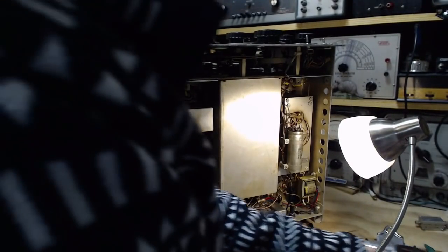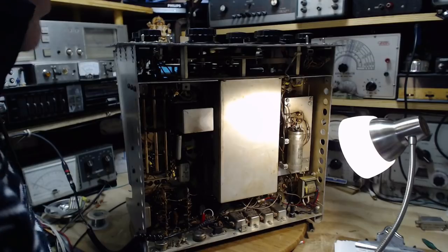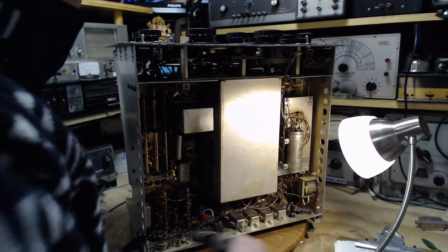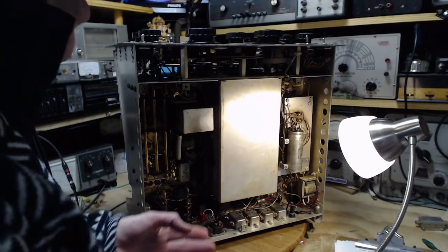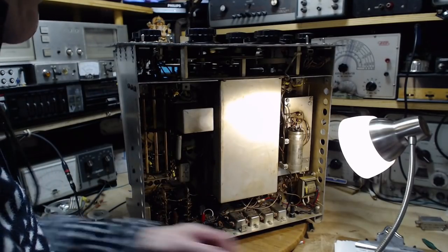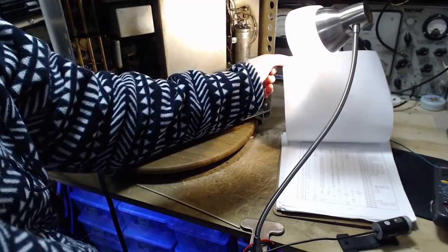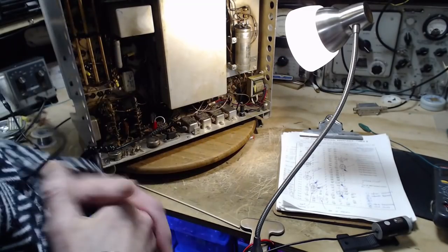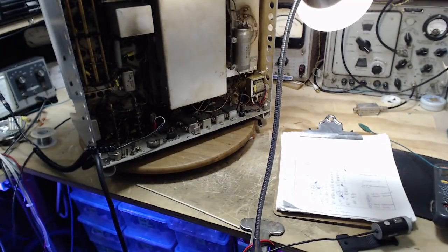So I've driven out all these problems here. Most of them just kind of evaporated. Made one repair, broken lead, oddly enough. Very odd. Very lucky to have spotted that. Next stage is operate the radio like I just was, measure all the pin voltages and compare against this chart here. And at that point, I'll kind of know the set is in its proper operating condition, if you like. From there, we can start looking at alignment, performance, and all that kind of stuff.